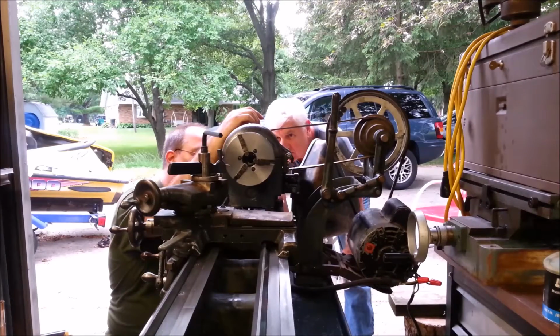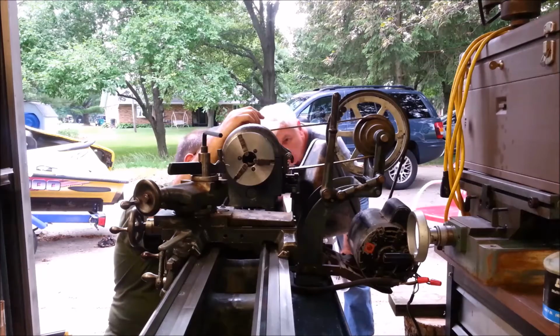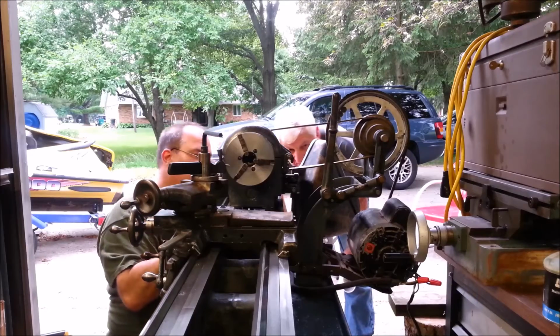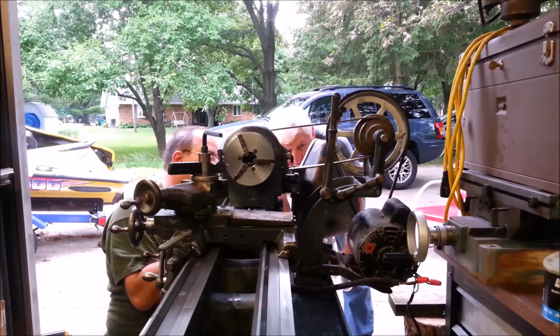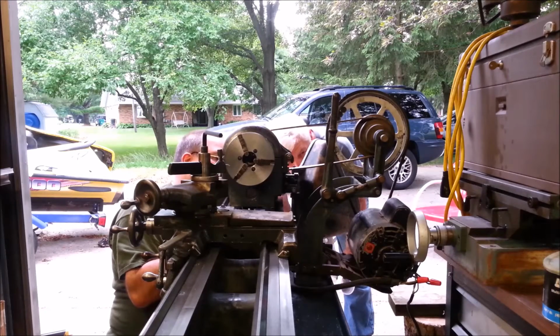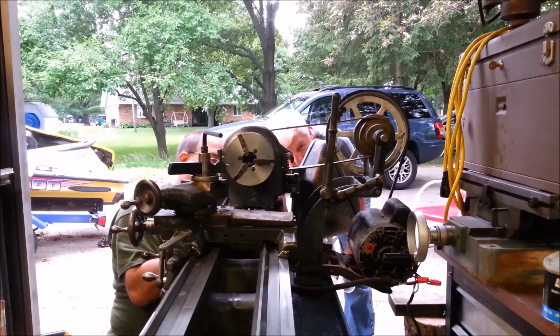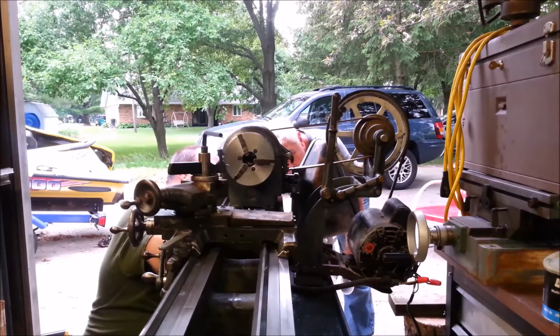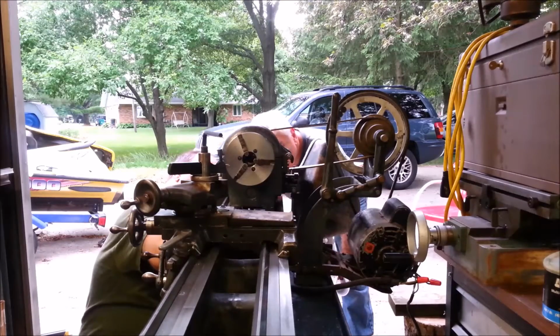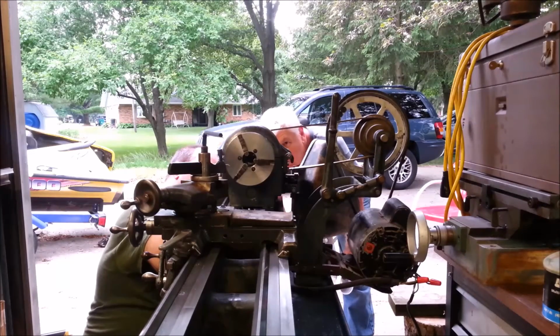Oh, so what would be the idler gear? Stud gear, idler gear. Oh, here's the idler. That's what's on the lead screw. So it looks like you mostly are using the 60, the 64, the 72. I think all of these are 72. That's what those little hashes mean. And then the screw gear. Sometimes you're using a compound and a screw gear. Sometimes you're just using a screw gear, in which case this goes away. Or wait a minute, no, this would be the screw gear, and this goes away.